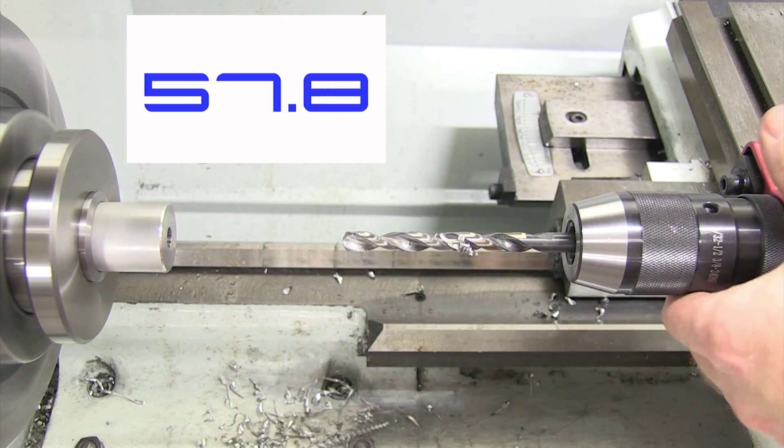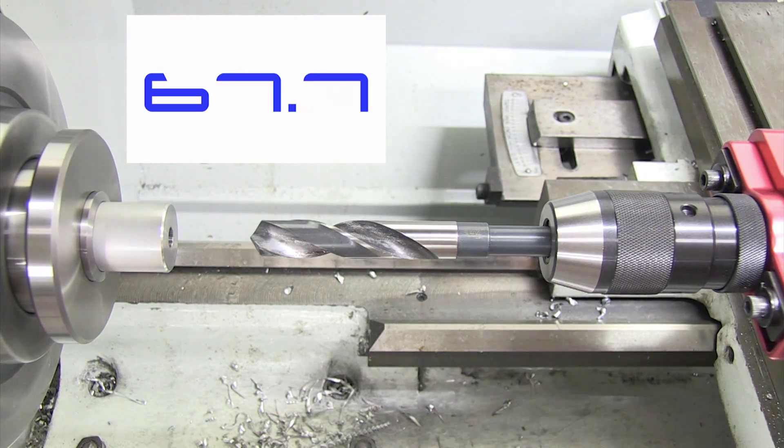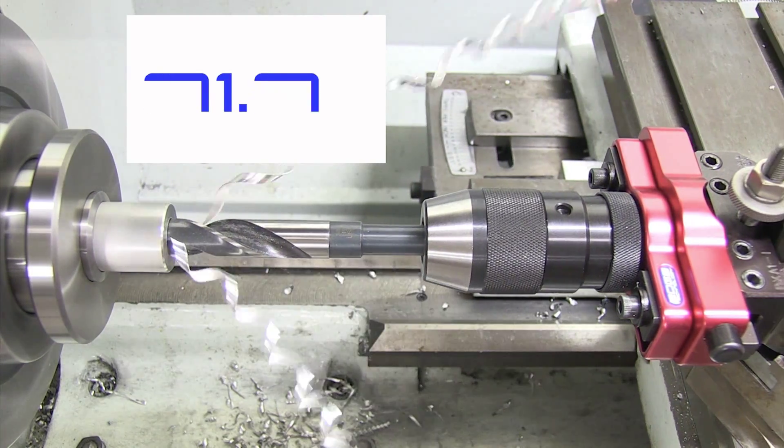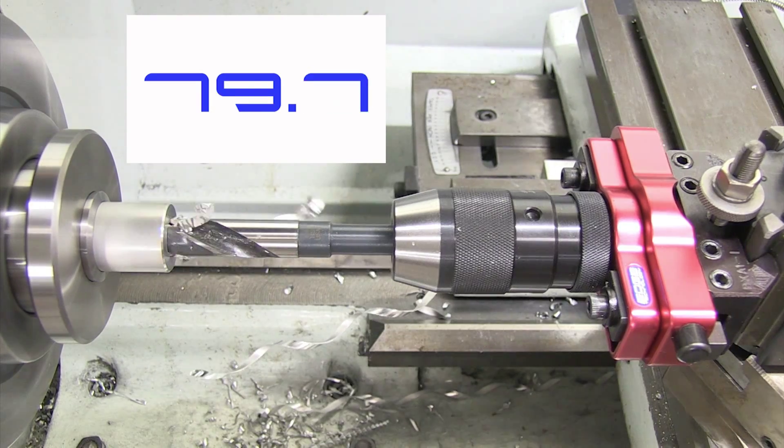This clip also shows the benefits of using multiple tool post drill chucks and setting each one with its own tool length offset in the DRO. The cycle times for drilling holes using this method are approaching what is typical for a CNC lathe.